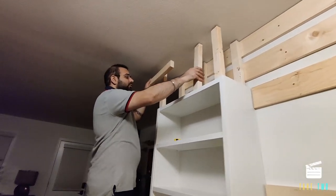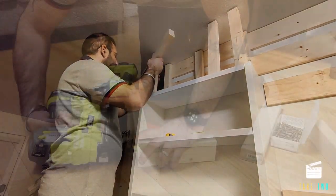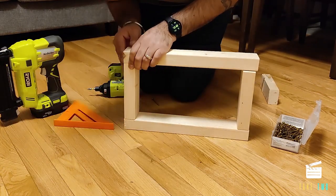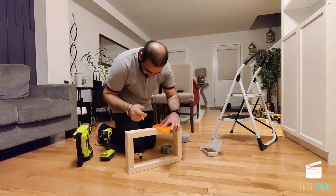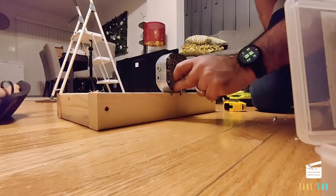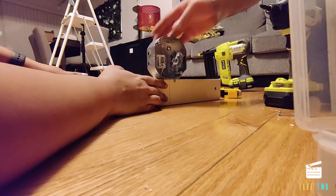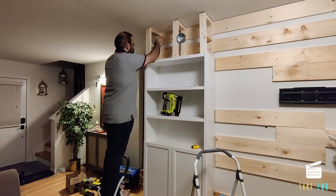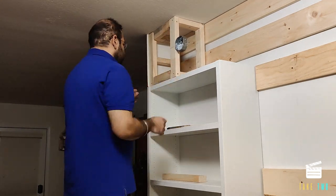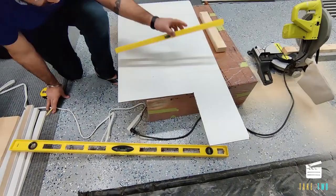For that we used two by threes and made a frame on top. We had to make sure it was in the middle because we had planned to add a light fixture on top. Using a brad nailer and a set square we made sure the frame is aligned and straight. We used a circular gang box for the lamp fixture and fixed it into the frame with wood screws. We had minor complications because the wall wasn't straight and had to make a few adjustments to the frame size. Then we drilled it to the back side of the studs.